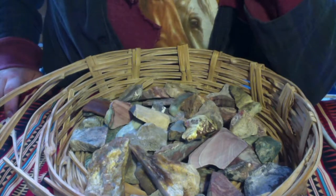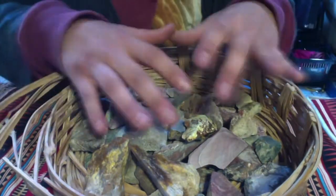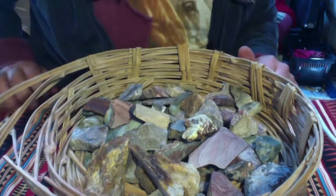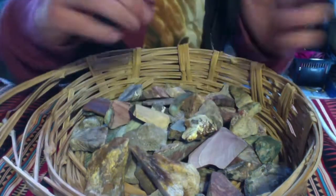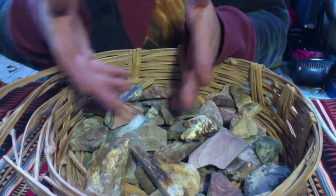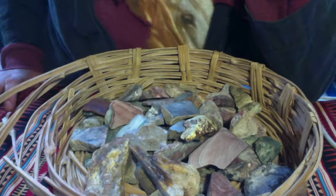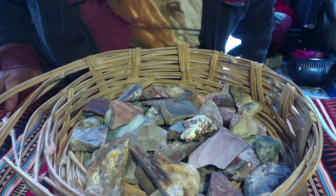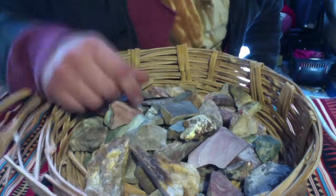After the 220, I'll be taking all of these stones to silicon carbide sponge-backed flat laps to take them to about 1,000. From there, I'll decide what's going to be finished more, what's just going to get Zam or Fabulustre diamond paste, and what's going to be taken to 14,000 on my diamond grinder. Anyway, right now, the last two hard flat laps. Let's do it.